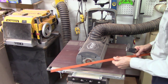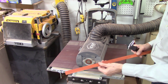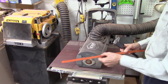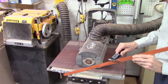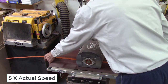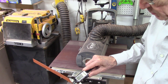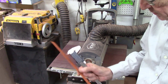I don't normally sand my strips on my board sander before gluing, but because these are for inlay strips and I've got a lot of small pieces with a lot of tight joints, I'm just running them through the sander to very lightly take off one or two thousandths — just to top off some very fine saw marks. I'm starting with boards between 53 and 54 thousandths of an inch thick, setting the board sander to around 50 thousandths and sanding both sides without changing the depth setting. I only took off maybe one or two thousandths — just enough to get the fuzzies off.